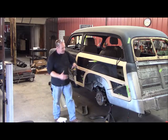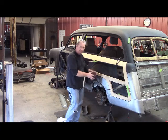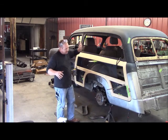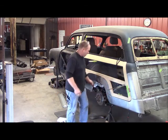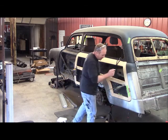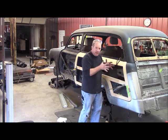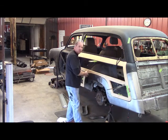Alright Bruce, this is really coming together now. This has been extremely challenging finding the numbers for where to locate this because the wood I have has some inconsistencies in it. It's not exactly like the other side. The other side of the car is a different length than this side, so there's just no way to generate these numbers other than coming off of what little bit of damage I had right here. The placement of that rear cab corner involves a lot of factors because the way it comes around dictates the way the side of this car is going to be.